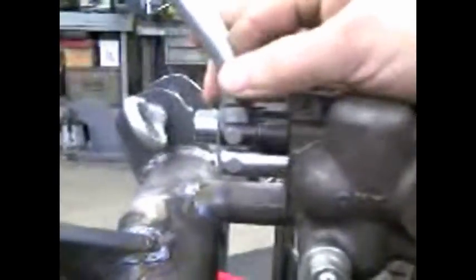Here's the control valve, which is actually mounted backwards. The hydraulic hoses come out here, and there will be some stands where the two cables will go. I'm going to take these handles off and make two more that just come up straight where the cable will hook to it — push and pull. I'll make another box that sets here with two extremely long handles that come up, so I get a lot of movement with very little movement in the beam but a lot of movement in the cable. That's the reason it's mounted up backwards.